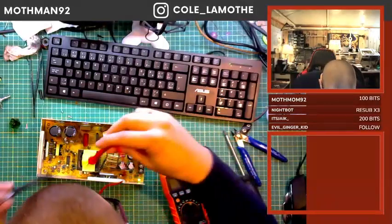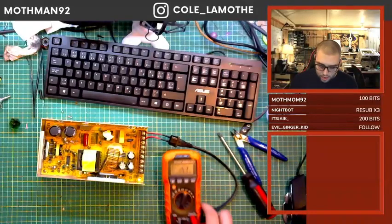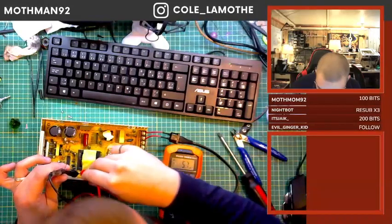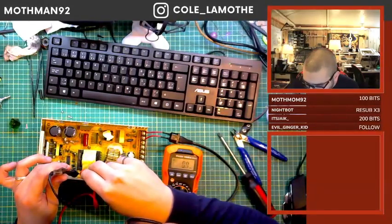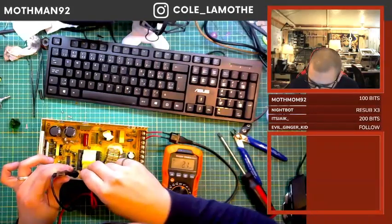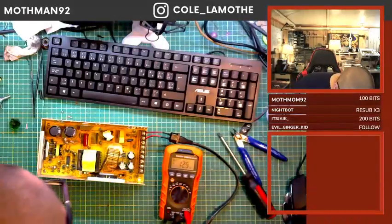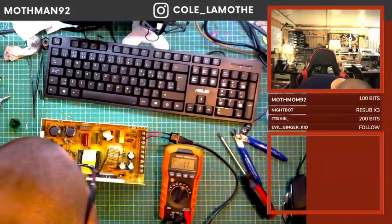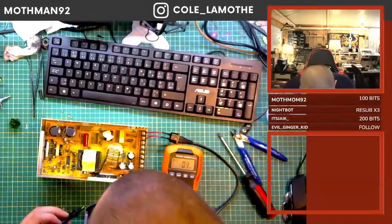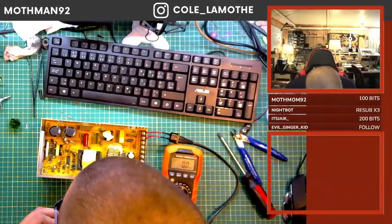So what we're going to do, very carefully, is reach down with a DC voltage measurement and poke our little fan header and just see. Zero volts. So for some reason, this power supply has just given up on sending 12 volts to my fan header. I don't know why immediately, and it's mildly annoying, because that is not normally a header that would fail.